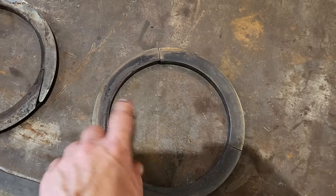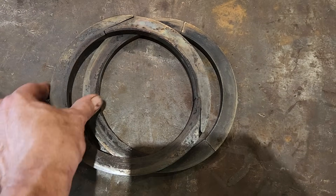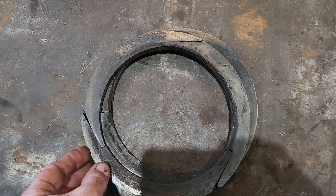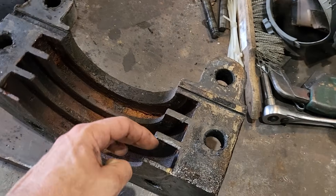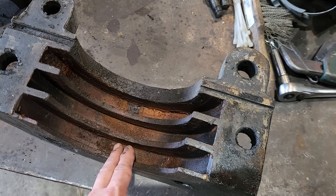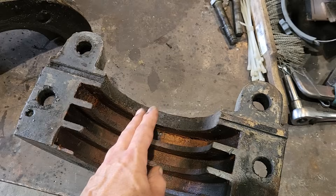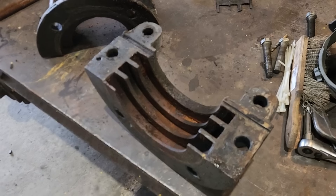Then you have these radial rings, and all the radial rings do is sit in place next to it so that when there's that little gap, there is something right up against the rod behind it that prevents the steam from passing through. They do it in three segments so steam coming in through here has to try to get around all of this, and if it does it's got another set of packing to get through, and if it does that it's got a third set — and hopefully by then the steam has given up and doesn't come shooting out into the atmosphere.